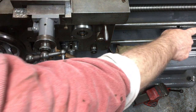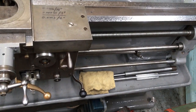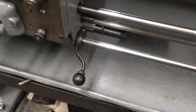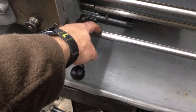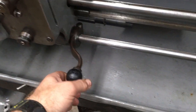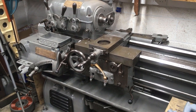Annoyingly, to get at it I've got to take the end off the lathe to slide it out, so all that bracket has to come off again. Fortunately, the brackets were fitted with dowels that have threaded holes on the back, so I can pull them back out. This is the handle after it's been repaired — you're looking at the free play before anything actually engages. I'm not moving the shaft; that is basically the play between the keyway and the key, plus the free play in the clutch moving the dog slider backwards and forwards before it engages.